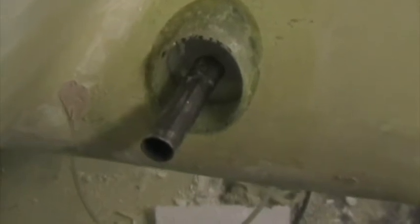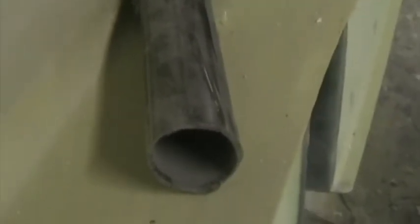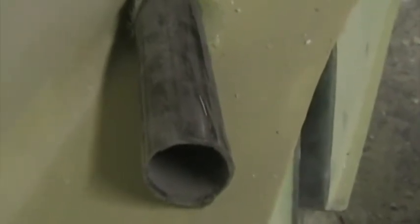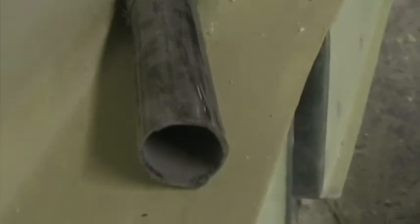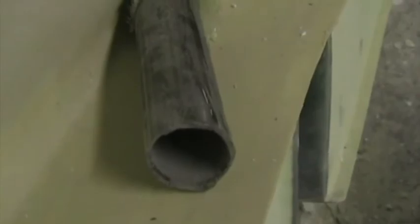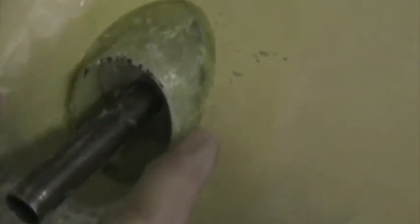Here I've made the tubes into which the wing pins fit. To do this, I took a scrap piece of 45mm outside diameter tube, waxed it, and then laid up some 410 gram glass, approximately three layers around it. Once it cured, I split it and removed it, roughened the outside, gouged out a bit of foam around the front here so as to get a good bond.